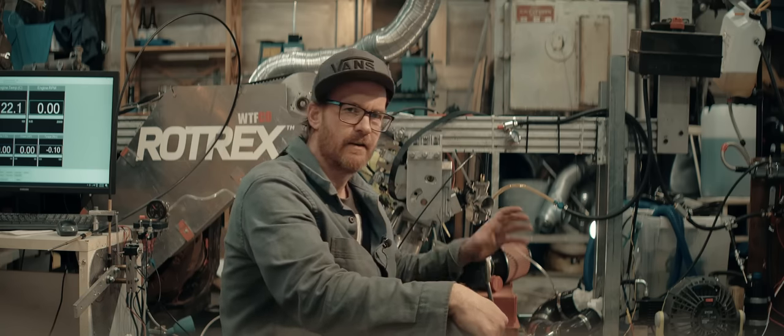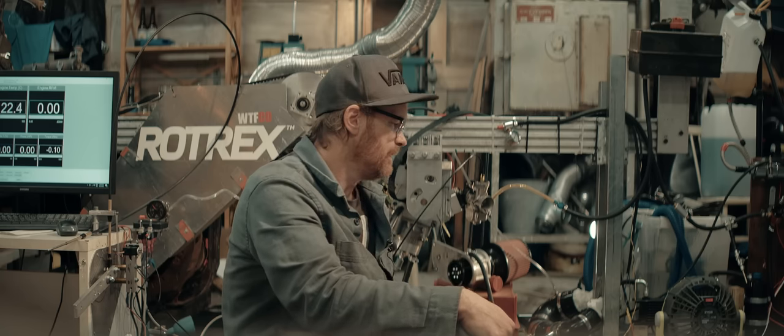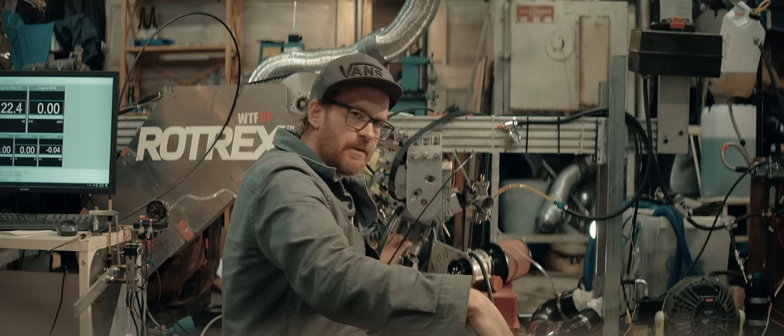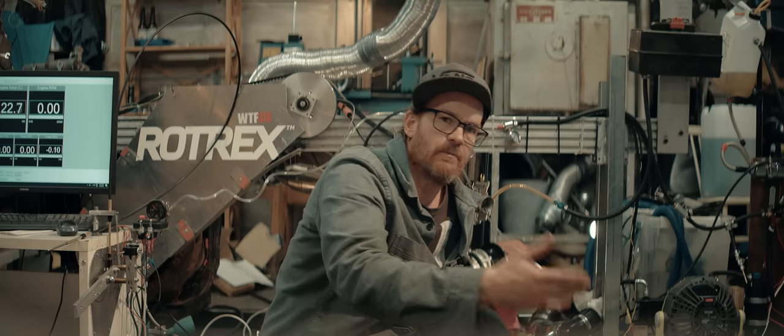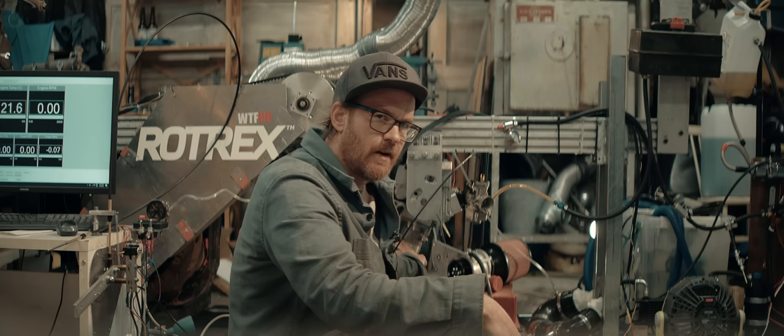I had to set really high timing at low RPM to get it going. And I think that really high timing, which I couldn't adjust for at higher RPM, caused too much heat in the cylinder and the ring expanded too much and caught a port. And also my ports weren't properly chamfered. They are now. I know the squish gap is almost twice what it should be.